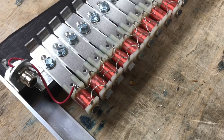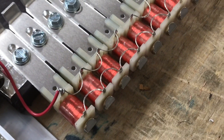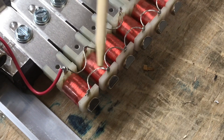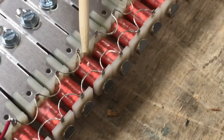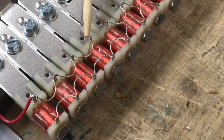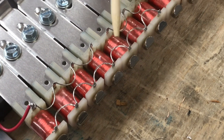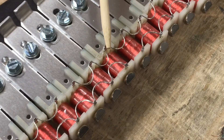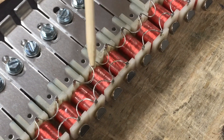To illustrate this, we're using a Vintage Vibe 73 harp without the tone bars installed yet. You'll see one, two, three, four pickups — a parallel grouping of four pickups — and then there's a split. After that split point, we have one, two, three pickups, then another split point. This is the series connection for that set of three pickups.